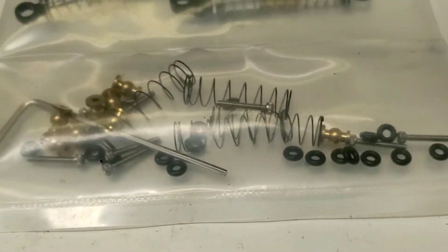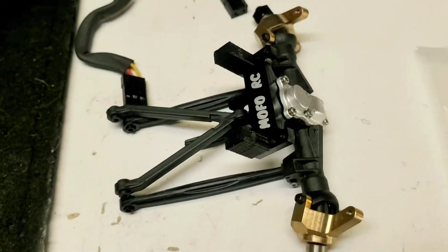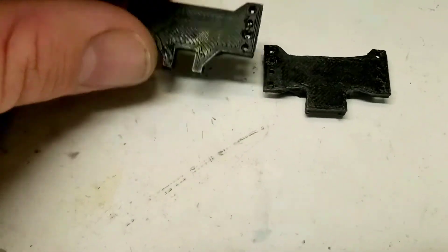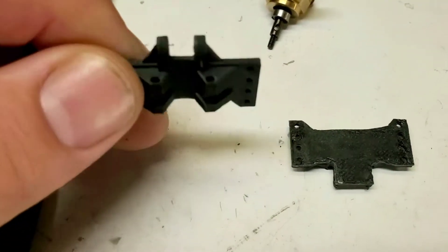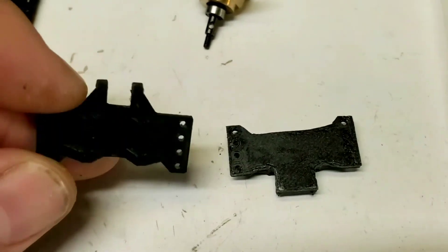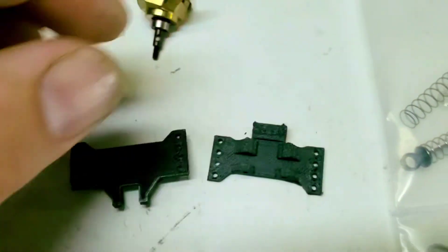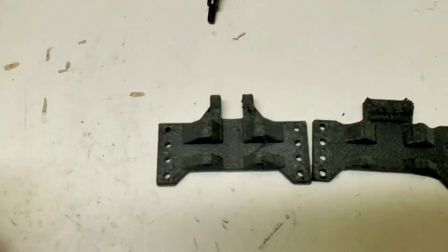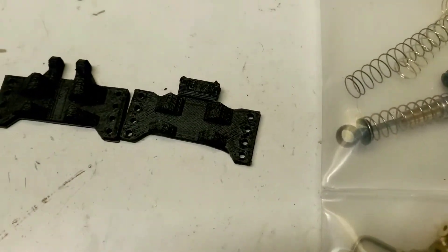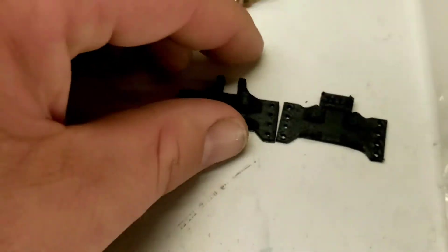The servo mount itself — the new one is a lot like my old servo mounts. Here are a couple of the old ones. This was the three-link servo mount. They're both printed out of carbon fiber polycarbonate, very strong but quite hard to print. There are two styles because the little arms on the three-link aren't quite strong enough to hold the four-link setup when compared to aluminum.